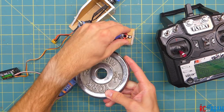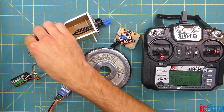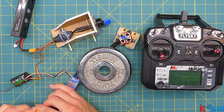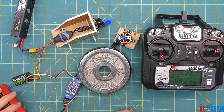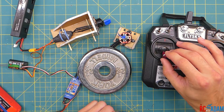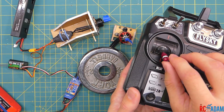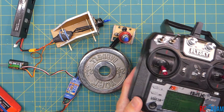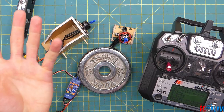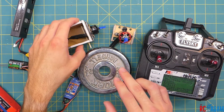Let's test it out. Connect the battery to both ESCs and when we raise the throttle, both motors should spin up at the same time. There is some dead space — some movement of the throttle before the motors actually react. The goal when setting this up is to make it so both motors start up at the same time and maintain basically the same percentage of power.